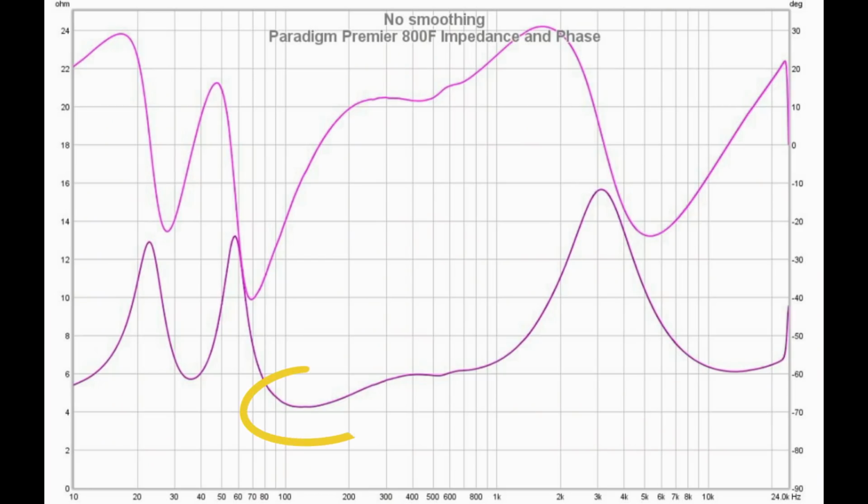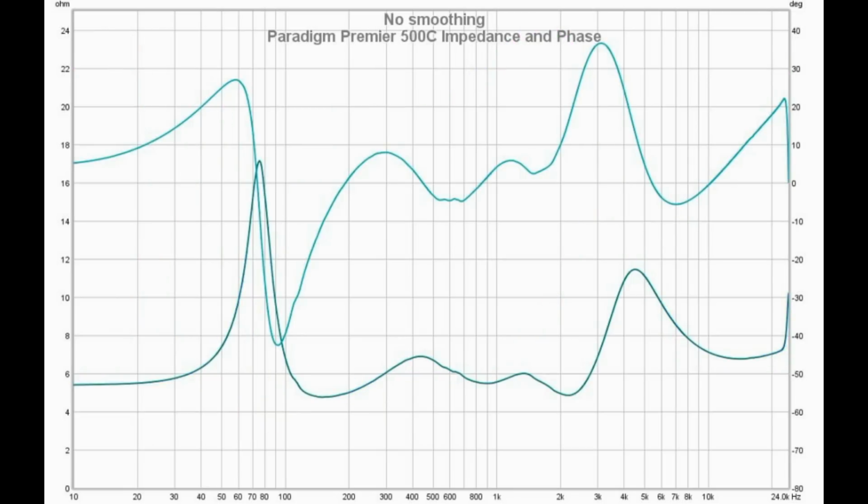And an actual honest anechoic sensitivity rating. We actually measured that, and we found the same sensitivity that Paradigm spec'd. And they claim it's compatible with 8 ohms, but in reality, this speaker is a 6 ohm speaker and it dips down to 4 ohms in about 150 to 200 Hertz range. So you want to use a reasonably stout amplifier. A good mid-level or higher end receiver should power these speakers just fine.